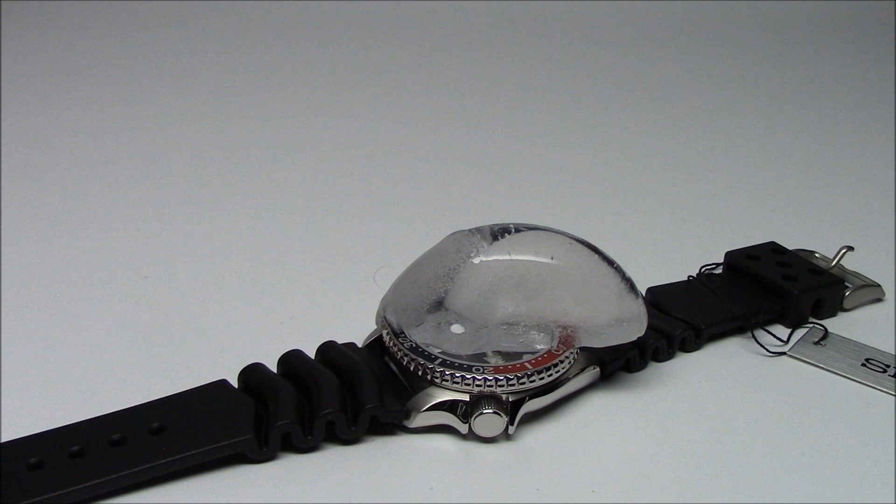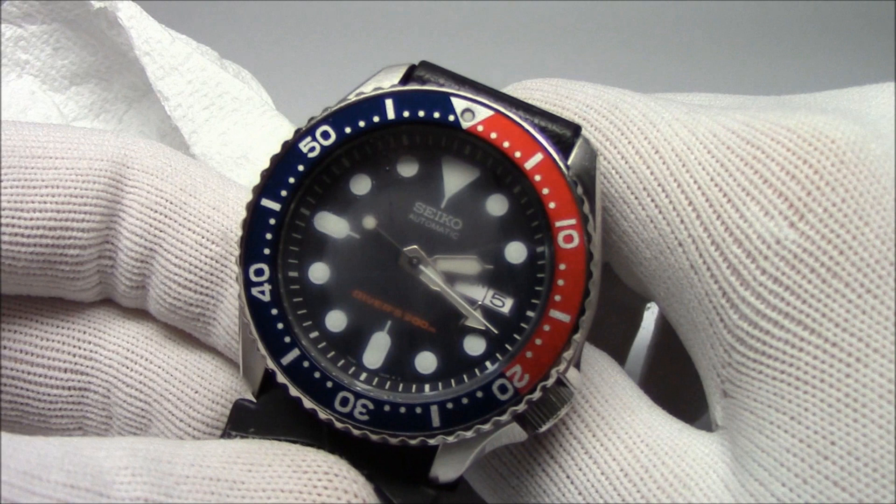This is not to be confused with what I demonstrated in Watch and Learn five or six, where I put an ice cube on an SKX and showed condensation forming on a completely watertight watch — that condensation disappears within seconds because you're just drawing the natural moisture in the watch to the surface, and it goes back into equilibrium. Here we're looking for moisture that actually stays behind. If cases failed, you can go back to the witness test to figure out the problem area, or change the crystal, change the seals, change the back, whatever the case may be.